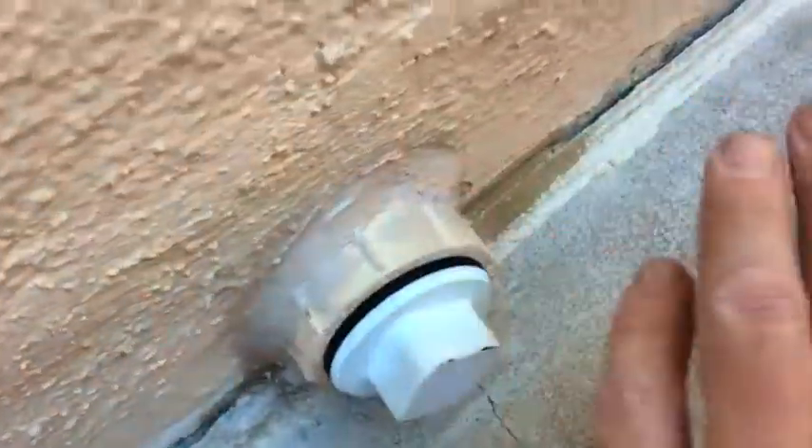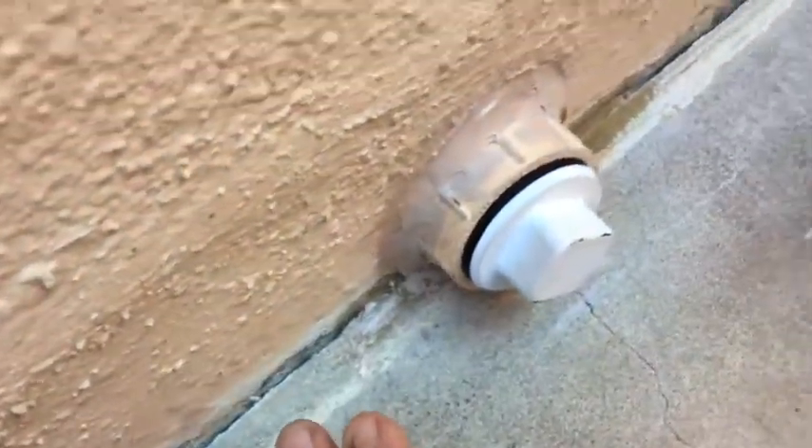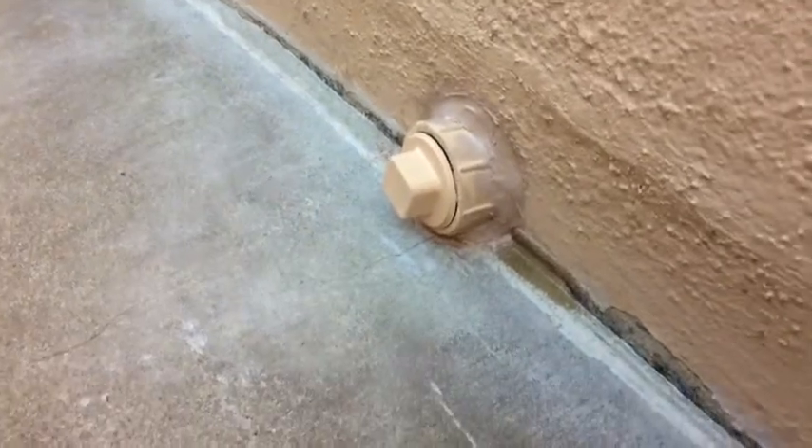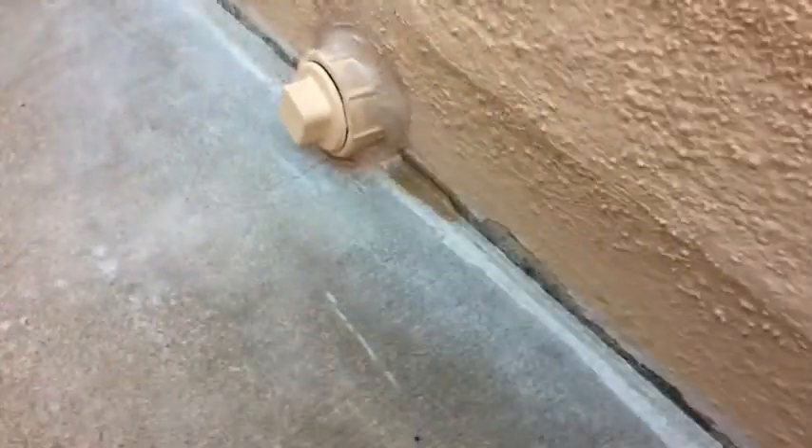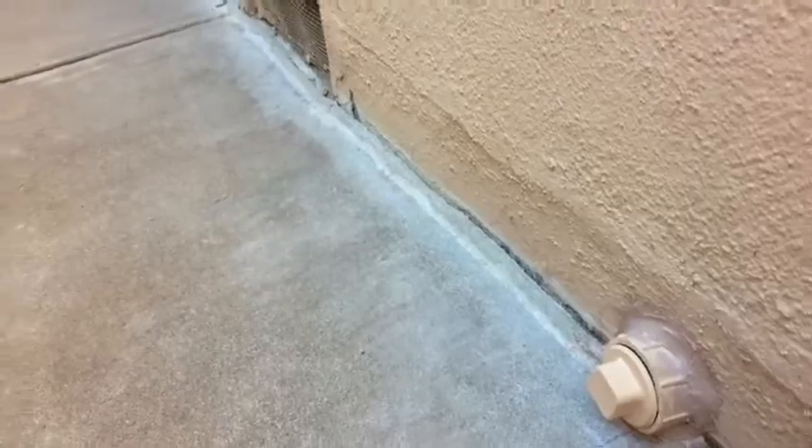There's our clean out right here — I have to paint the cap. My job is to also do some other work, so I'm going to fill this crack and then I have a textured stucco patch to put around here, which is also an acrylic product. Here's one more shot of our clean out — I put a lick of paint on it after the sealer's dry. After a little bit of patching around here I'll give it one coat of paint and that will look really nice. So what's the moral of the story? Expect the unexpected — like six inches of concrete including the stucco. If you'd like some help doing this sort of thing, please give me a call or an email. Do hit the like button and the subscribe button — that helps get these videos out there. This has been Kent with KJS Painting and Renovations. Thanks for watching.